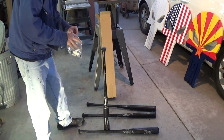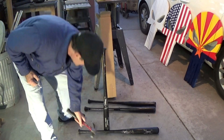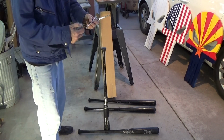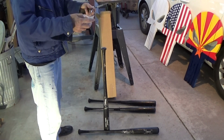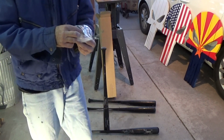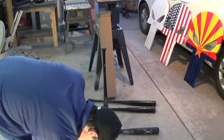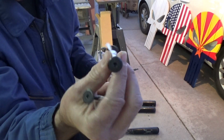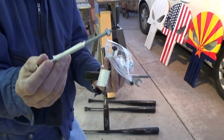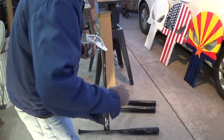And my goal at this point for tools, I just have a hammer to tap everything in. I don't really need to tap with 3 of them, just 2 of them. And these are 1/4-inch bolts, and they have a 7/16 nut. And then what I have are some unique bolts. You'll see these in beds or futons, where it puts it together so you don't have the end of a bolt sticking out like this. So I use these for sitting so your arm doesn't snag.